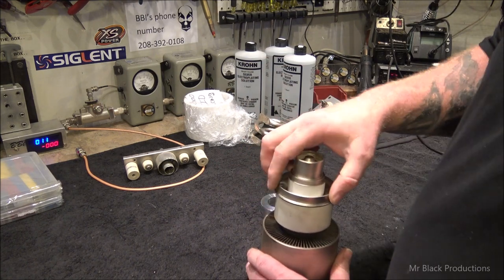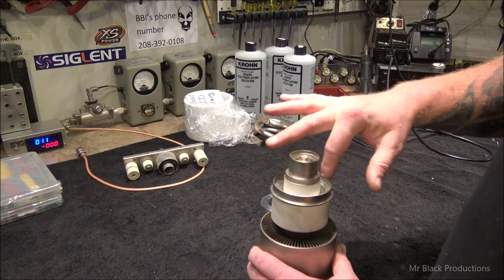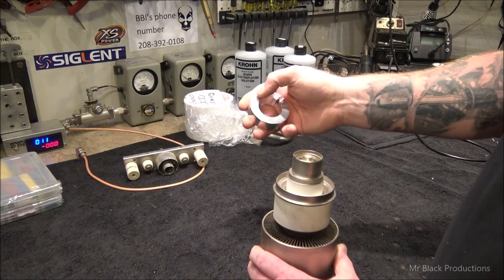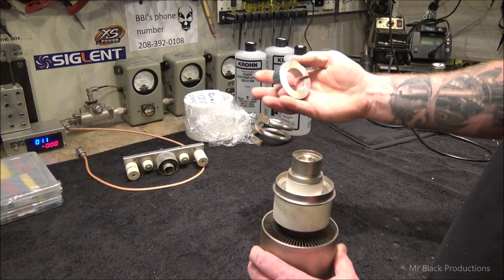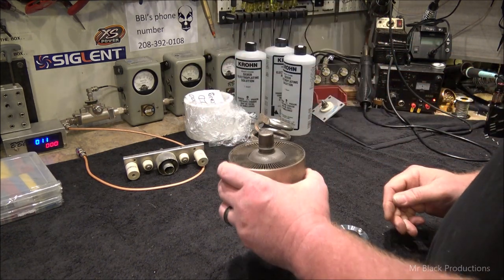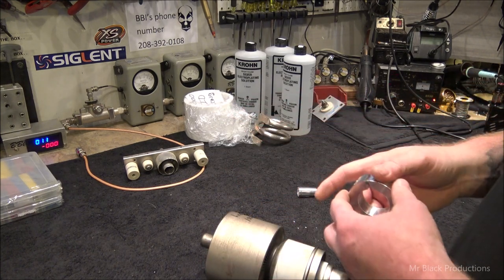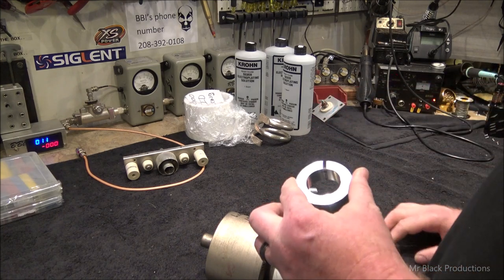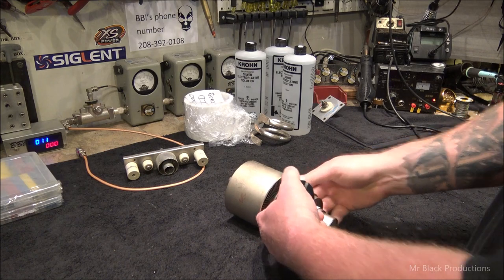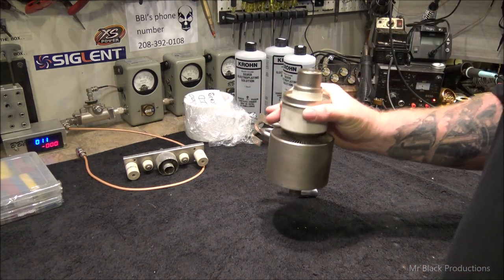Now, what I want my friend at RF Parts or RF Junk to do is create me a third collet that goes around the bottom of this, based off this same technology, that we could then in turn machine holes into. That would allow us to attach this to the bottom side of the amp deck. So you can slide the tube in, boom, into the hole, which is going to be, what, a 2.5 or whatever inch opening. And you're going to have your machined holes, tighten it down to hold the tube in place, and come along with an Allen wrench and tighten it, and the tube can never pull out of the deck.